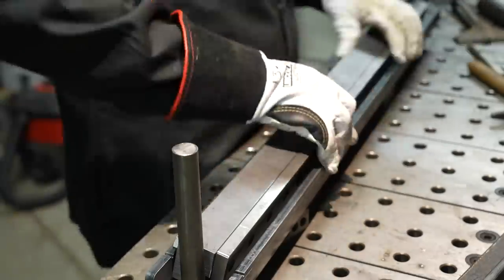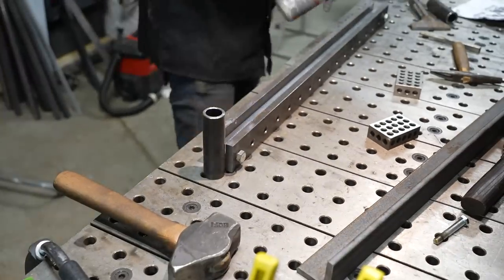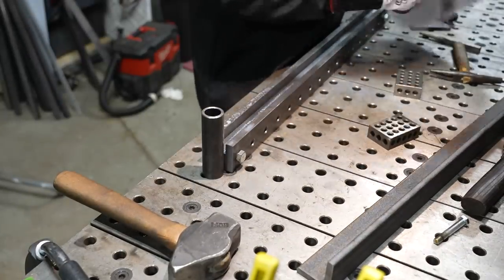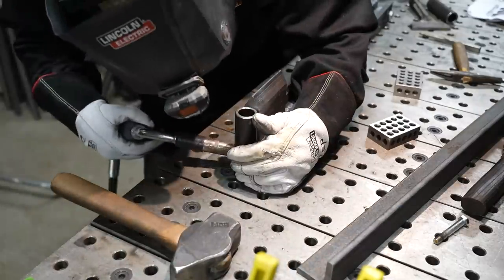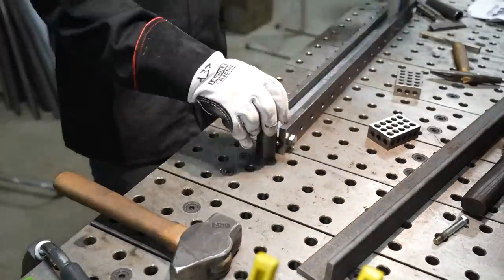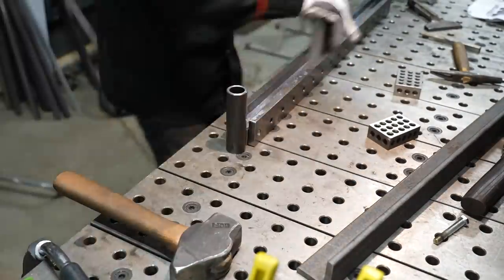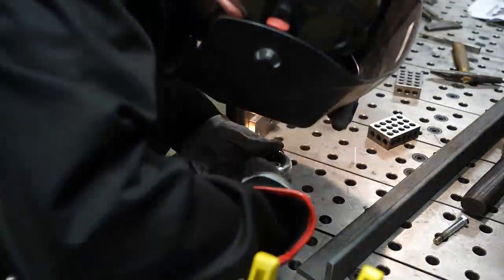The top section of the finger brake is this heavy piece with some holes drilled and tapped in it so that you can grab the different fingers. You have to weld the guide bushing on there — you want that to be square and also not weld it to the movable part. Again, everything has to be square, otherwise when this thing closes up it will rack.